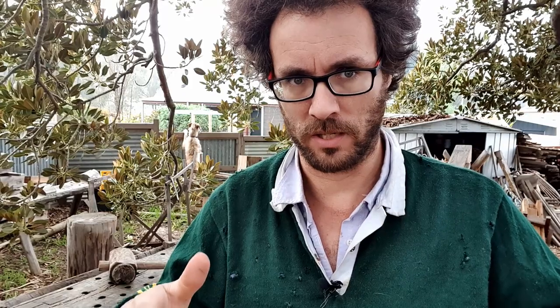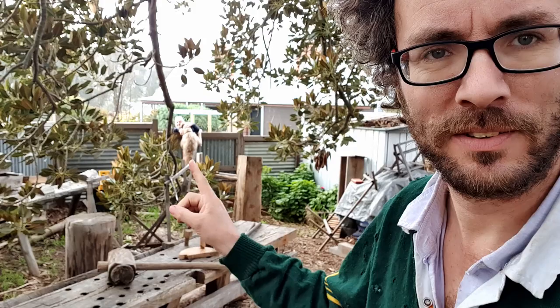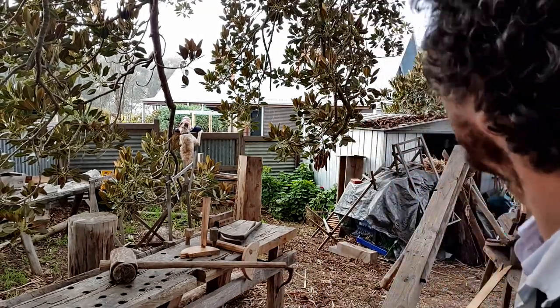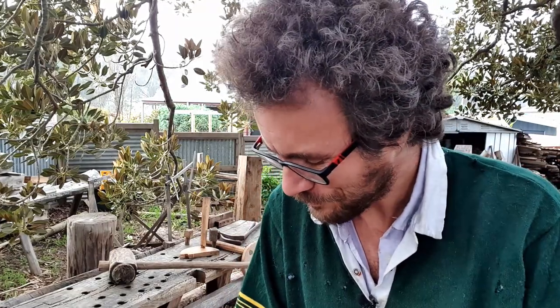With the reed, I did the extreme gables — laid a strip up each side — and then tried to blend the material. What I did was get a bundle coming in one way and then a bundle coming in the other way, then did a sort of stagger. The idea was that water would flow off one side, then the other, zigzagging its way down. That didn't work very well, and from further research I've done since, laying valleys is a skill in itself.